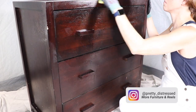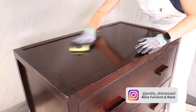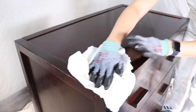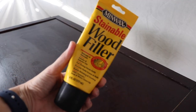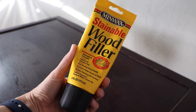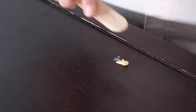You can use any kind of soap or cleaner that you have — you just really want to make sure that your piece is clean before you try to adhere any paint to it. No matter what cleaner you use, always wipe it back and rinse with clean water afterwards. The rags never lie — your paint's not going to stick if there's residue, so make sure you get it off. My piece has a lot of nicks and dings, and since I'm going for a smooth modern finish, I'm using a paintable wood filler to fill in any imperfections.